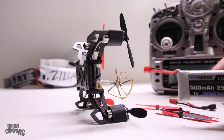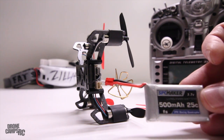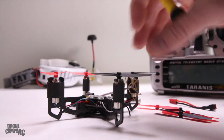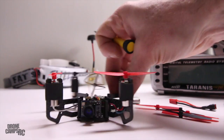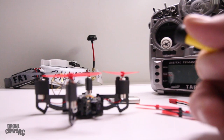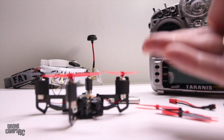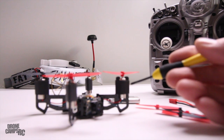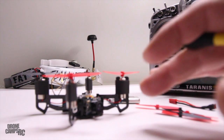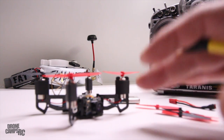That's a little SP Maker 500mAh 1S 25C battery. Let's go ahead and hook it up to CleanFlight. I'm going to show you some tips on how to set this one up, set up your modes, and some important information on how to get your motors working and armed — because the PWM rate has to be set in CLI before these motors will start to work.